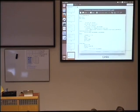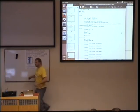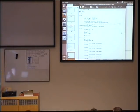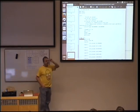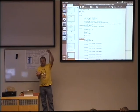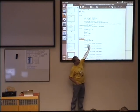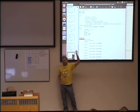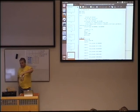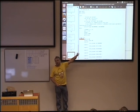Can you see it? It looks strange if you don't know how microcontrollers work, but it's very easy. I have an interrupt here. Every time someone writes data to that chip, there is a piece of memory called scratchpad memory where you can write and read data. So if someone tries to read or write, I check what is written to the memory and then change some pins. This is the controller for a 7-segment display. It's very easy to use this kind of microcontroller for your own modules.